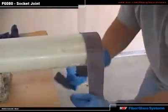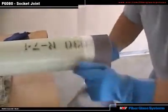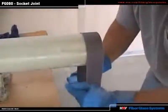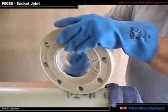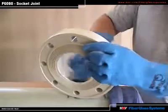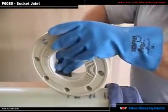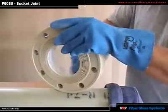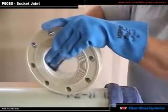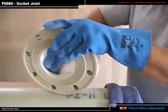Be sure to protect the sanded area of the pipe from dust, dirt, oil and grease, and water. Do not use any kind of solvents to clean the pipe. Once you have the surface sanded and contaminant free, do not touch the pipe with your bare hands. Fitting sockets are sanded during manufacturing, but it is necessary to freshen the socket surface to eliminate contamination prior to use by sanding with a 36 to 60 grit emery cloth. Always make your fabrication as soon after sanding as possible. If you wait at least two hours after your pipe and fitting have been sanded, you'll need to sand them again to get rid of moisture in a high humidity area or dust that may have settled on them. It is imperative that you mix and apply the adhesive as quickly as possible after sanding the socket.